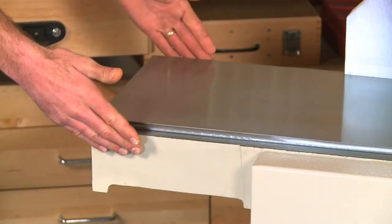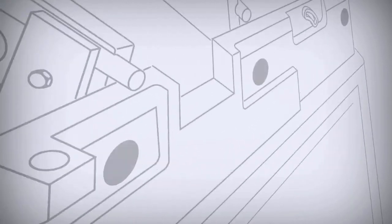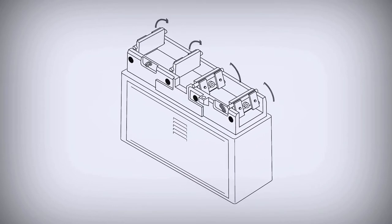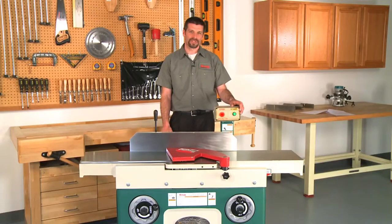The tables are 13 inches wide and an unheard of 4 and 1/8 inch thick. The tables are attached by a parallelogram height linkage mechanism. Interlocking mounting points move in unison, maintaining the tables in an ideal parallel position. If the tables were to get out of parallel, the mounting points are independently adjustable, so getting back to parallel is a snap using a simple straight edge.